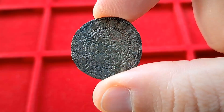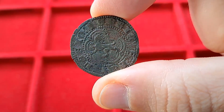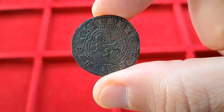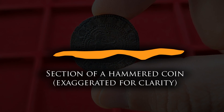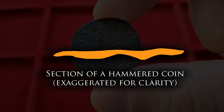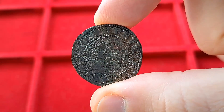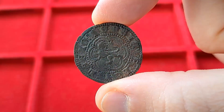The end result was this lovely little thing here. Sadly, as a coin — as money, as a tool of transferring value — medieval coins had a series of problems. First, since the initial metal sheet that would generate the coin flans was manually hammered flat, it resulted in flans of uneven thickness. This led to coins of different weights. The deviation wasn't too bad, a couple of tenths of a gram more or less, but considering how very valuable silver or gold were during the medieval period, a tenth of a gram here and there did make a considerable difference. Coins excessively underweight or overweight had to be melted down and restruck, adding a lot of inefficiency to the minting process.